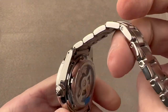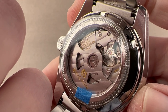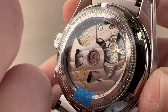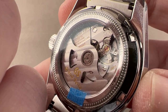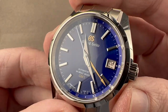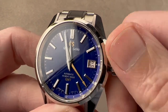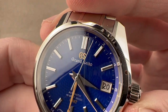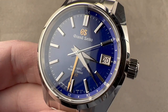On the reverse side, we do have a sapphire case back. It's a limited edition of 500. Features a caliber based on the standard 9S — it's the 9S86. Automatic winding, 36,000 vibrations per hour like a Zenith El Primero, pivots on 37 jewels, and it is hand-adjusted in six positions, which is one more than the chronometer standard. Grand Seiko and Seiko make every part of the watch, right down to shock protection and even the very lubricants used. It has a timing tolerance of no worse than minus three to plus five seconds per day, which is actually better than a COSC-certified Swiss chronometer. Because of the 10-beat per second rate, the seconds hand sweeps smoother than a conventional 4 Hz, 3 Hz, or 2.5 Hz Swiss movement. Reach out to tmaso@thewatchbox.com for purchase and pricing details.